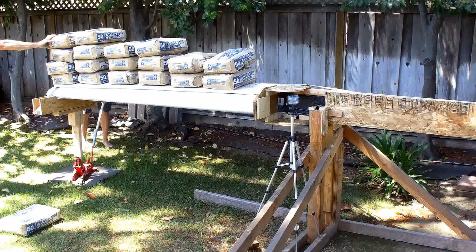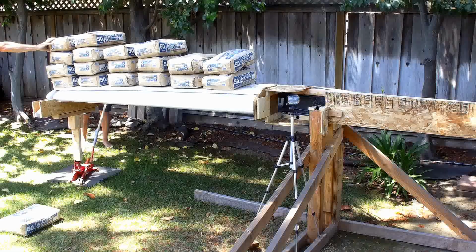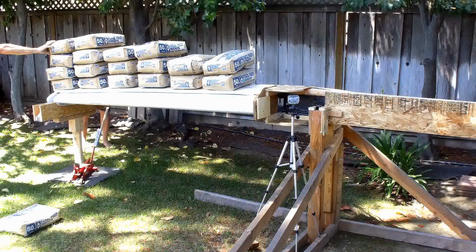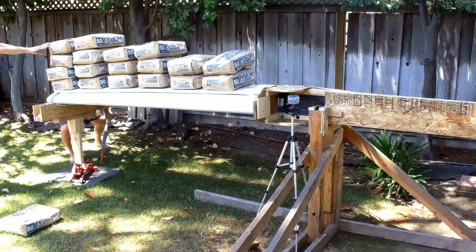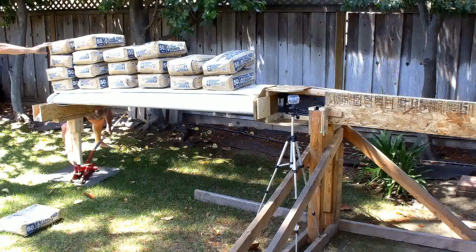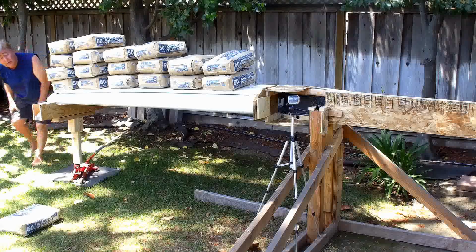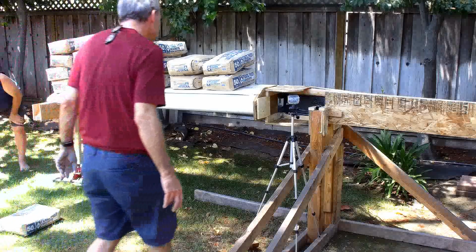Don't get hurt. Going down slow. Slow. Okay, that's 3.5 Gs. My fingers are off. Okay, I didn't hear anything other than a little creaking. Let me just snug the jack a little. Okay, right there. What's the bending like? Trailing edge is bending a little bit more. Leading edge, for 3.5 Gs, I would expect a little bit of bending like that.